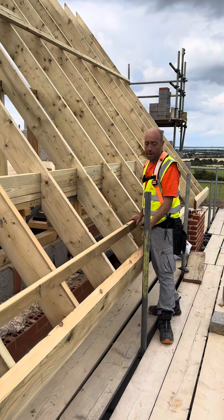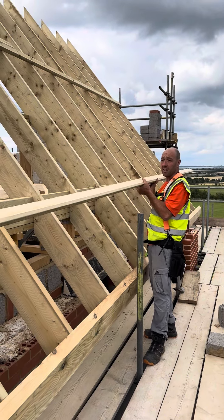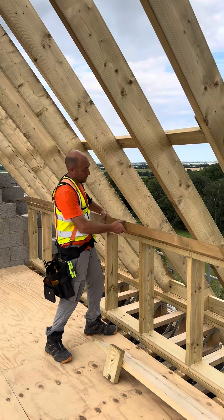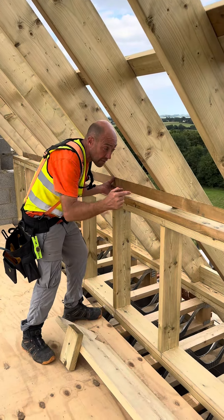Timber walls — let's say you need a metre wall. By the time your wall's in and you follow that plasterboard line up, it's not always a metre — it's a lot bigger. So what I do is get the timber to the size that I need, level that, and hold the timber which is going to be the stud, just run it up the back to suit. I'll draw a line with a piece of timber, and when that's in, just slide it up until it suits. Whether you're having one plate at the bottom and two at the top, I'll put the timbers at the bottom, measure off that, and then my studs work out well.